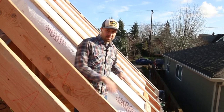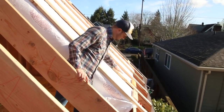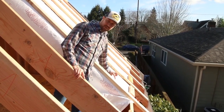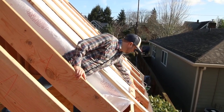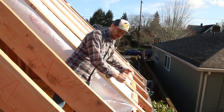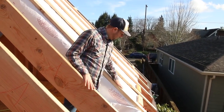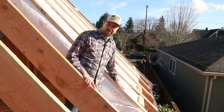The last step on the top side is to simply apply our sheathing. The plywood gets installed onto and nailed into the two-by-fours, creating that vent chamber, and then gets nailed to our blocks, which creates the structural diaphragm to keep our roof nice and rigid. On top of that plywood it's like any other building — you're just putting your roofing on top of that, and that's it.